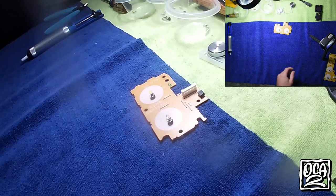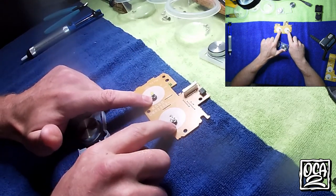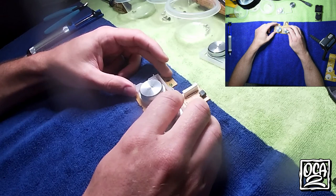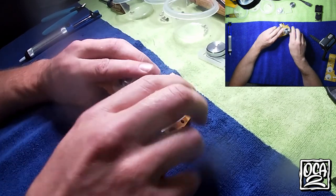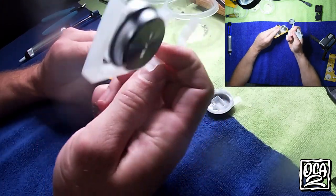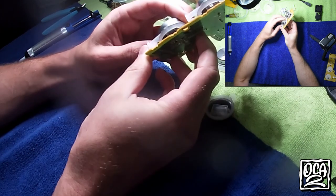When you're pressing down on your Q button, you're giving it a lot more mileage than the play button gets — roughly five Q button pushes to every one play button push. The problem is this button is offset, so you get different loading. They have to put the LED in the center for lighting purposes. The issue is that when you're pushing on the backside it goes directly into the switch, but when you're pushing up top it gets a lot more flex. That causes fatigue failure up front — it breaks off right at the joint.